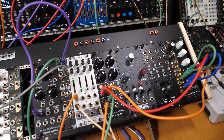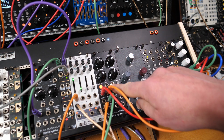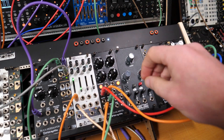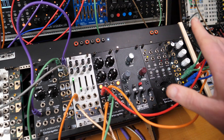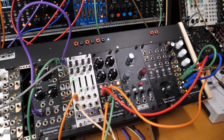Of course you could run the oscillator through a filter, and I used a similar idea on the second channel of the Dual ASR to loop and run the cutoff on the filter, with an LFO going into that to change it at a different time to everything else — adding another layer of randomness. You could use the end-of-cycle clock into a mult and put that into different things: run a sequencer, run other bits of modulation, other sound sources, other effects — whatever you like.